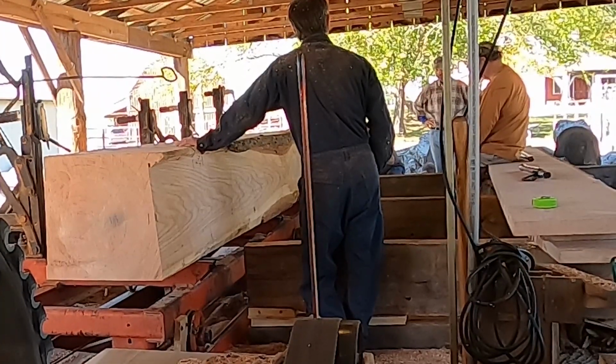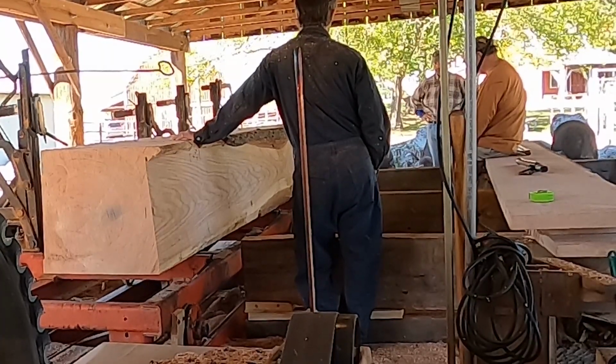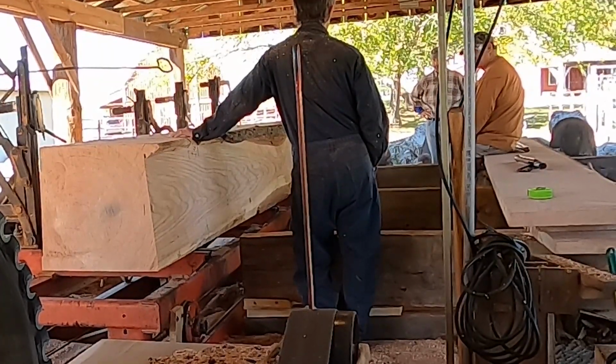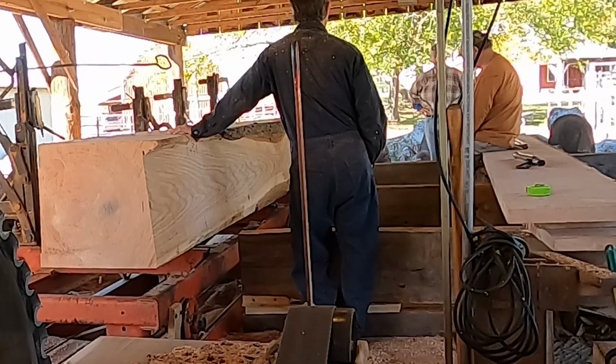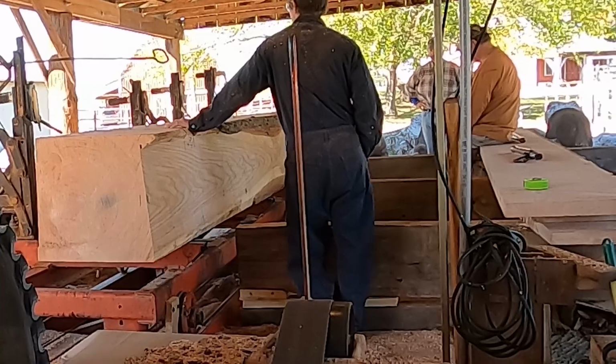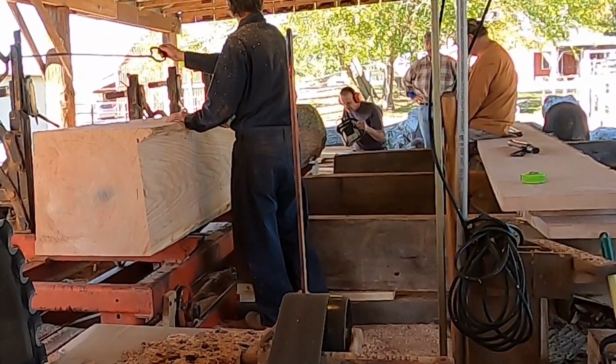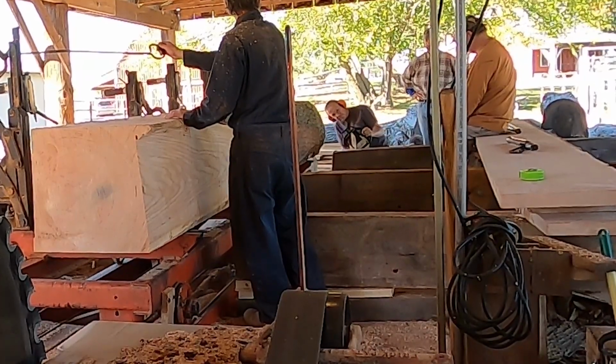So here we are making fine adjustments to the wood rack. What happens is if the log sticks out a little bit too far, it'll hit these large boards, they look like 4x12 or 4x14 boards, and it rubs on them. So as the carriage slides back and forth, the log gets stuck on the wood rack where the logs are stored before we mill them.